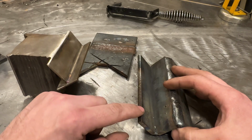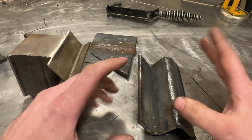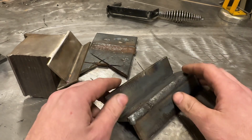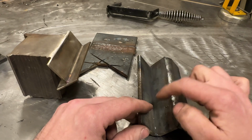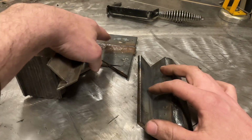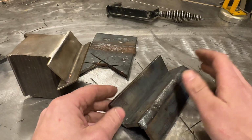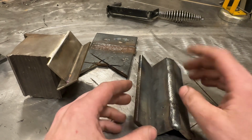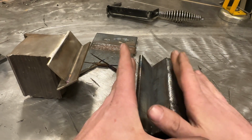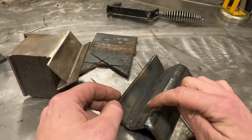So it's almost equal to a V groove that you would have in like 1.5 inch plate or 1.25 inch thick steel plate. So simply by welding this pass after pass and staggering them, so you're overlapping them, we can simulate a very wide thick piece with a very wide V groove bevel on it. And this is where I would recommend to start.